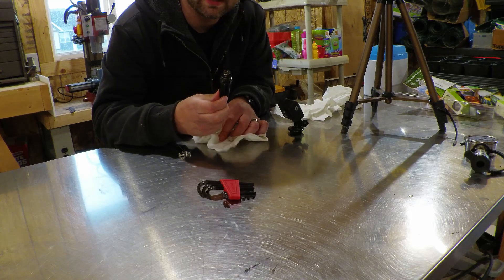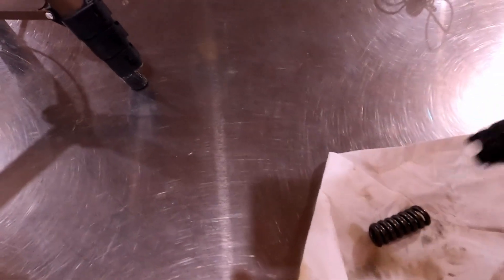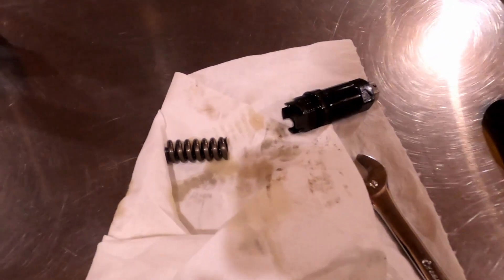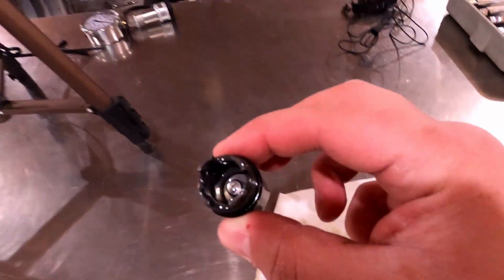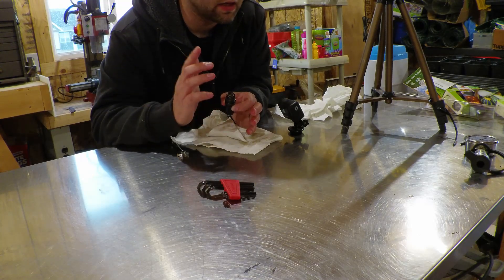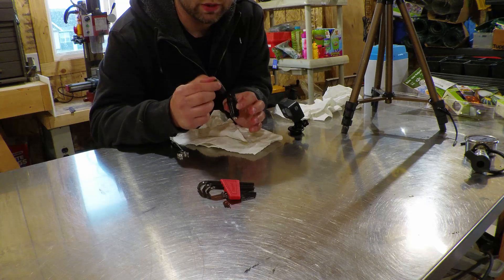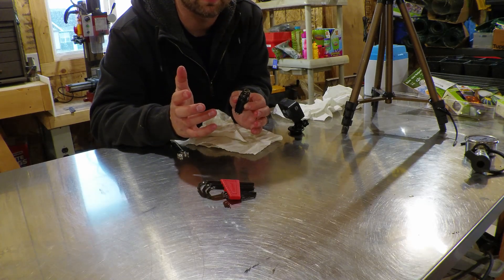Inside of it, be careful — some of these tractors may have shims in them already. You can dump it out to make sure there are no shims. Mine doesn't have any shims, it's just the spring in there, so that's what's controlling the pressure. If you want to increase that pressure more, heed what you're doing. Mine's under warranty so I'm not doing it. All you do is put some shim washers down inside here — each shim washer will increase that pressure. The seals on many tractor cylinders are rated up to 2,500 PSI. You can add shim washers to increase that tension, making it take longer to bypass and increasing hydraulic pressure and overall system performance.